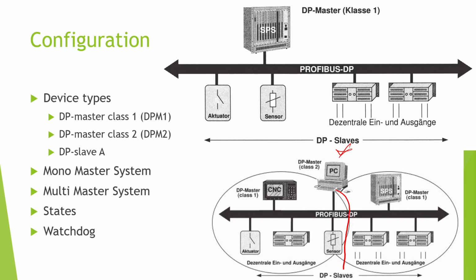Again, a local company with countertops: if something happens to one of the countertops in the line, they have to be able to remove that countertop from the line. That way the next one that gets processed, the following machine doesn't think it's the one that got removed and cut it and foil it and do whatever at the wrong places. And then they just have to throw that countertop out as well. Because they're making different countertops every single batch, it's not like we're just going to produce 50 of this one. No, it's one of this and two of that and one of here. We're going to use this color and that color and this backing board, and we're going to roll this edge. We're going to have a sharp backsplash, whatever the case is. Everyone's different. So if they don't remove the damaged one from the line, everything after that will be screwed up, so they just have to throw it all out.